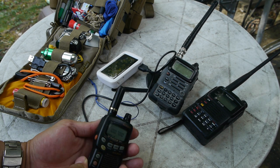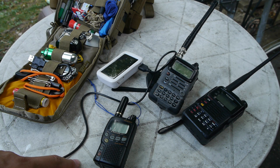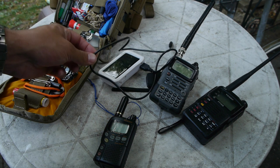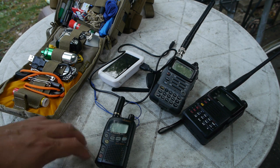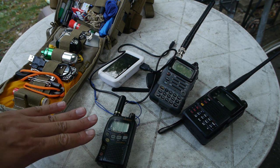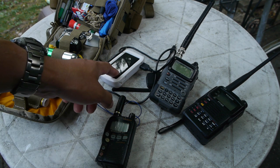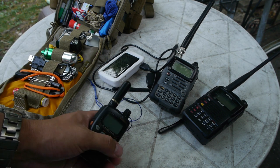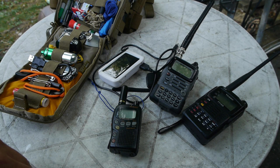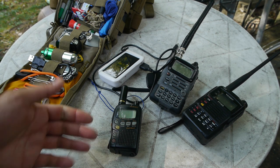But it works pretty well for a small radio in your EDC kit if you're looking for a very tiny radio that can do a lot on the receiving end and can be powered by a USB power source. There are other radios in the market that do this too — the VX2R and VX3R, the next ones up from this — but you cannot always run them off this cable. There's also a Yaesu that's sort of a copy of the VX3R; they're all in the micro HT category. I'd recommend the VX1R even though it only transmits at 500 milliwatts on a full battery or one watt on a six volt power source. With a USB power device it'll probably be transmitting a little above 500 milliwatts anyway. But it doesn't matter if you're on a hilltop or the summit of a mountain — you'll still get out pretty far. I still recommend it if you're looking for a small monitoring or emergency transmission radio, as you can cover FM and broadcast portions of radio stations. That is the VX1R in a nutshell.